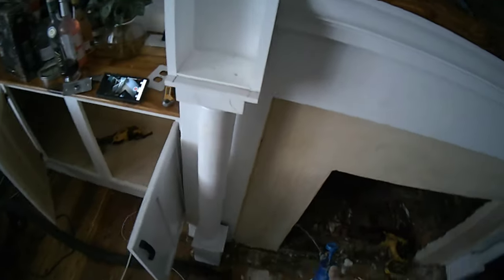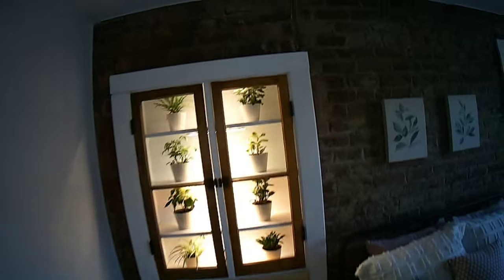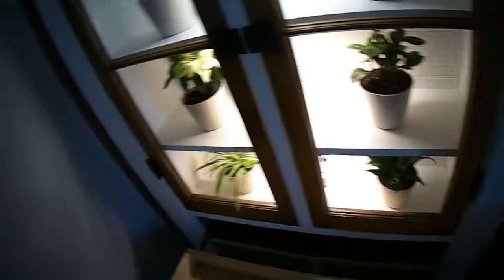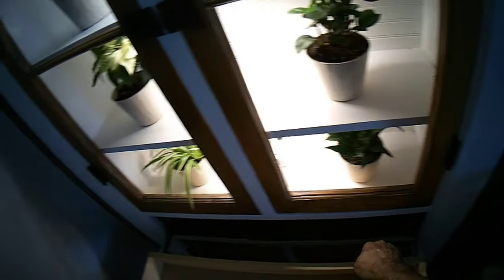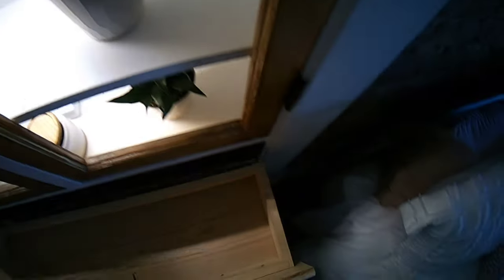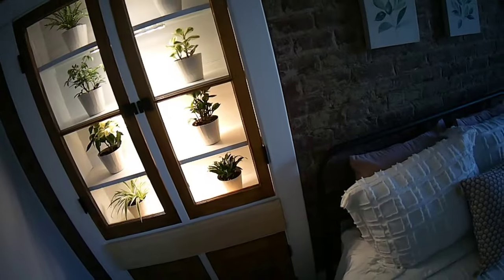I'll wait about a half hour and come back and put some more water on that. I also need to go get some more wood. This cabinet here was originally inset doors. What we're trying to do is make it so it can be used as a nightstand. We can't do the flush mount drawer because our drawer slides don't have enough space, so I'm going to have to notch all of this out so that way this will be able to sit closer to being flush. We'll paint that part white so it blends in better like the molding.